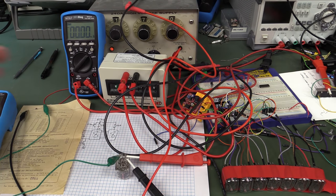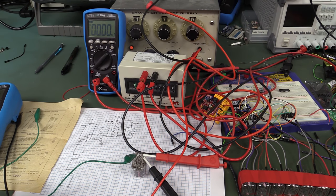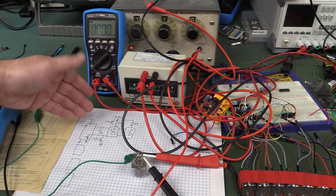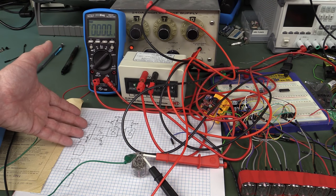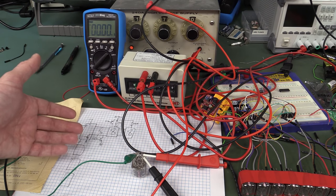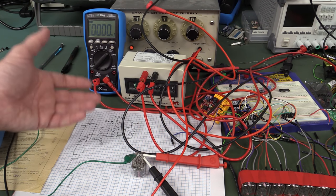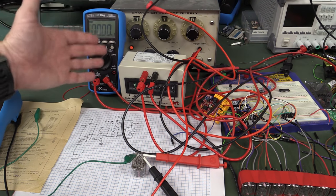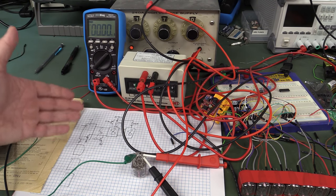Let's have another little look at just driving these Nixie tubes, because there's a couple of issues outstanding before we actually go into a final solution that we make into a schematic and a PCB. Now the first issue is, do you actually need a high voltage driver transistor here, be it within the custom microchip serial array that we looked at, or individual driver transistors, or a transistor array like a ULN2003? Do you actually need the full compliance voltage of 170 volts, or say 200 volts nominal, to drive these things?